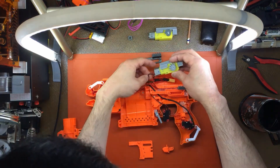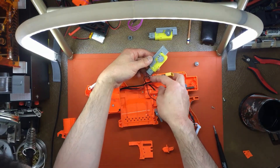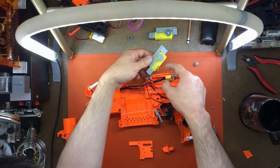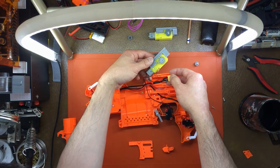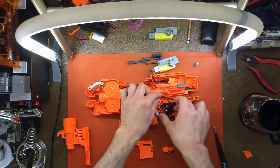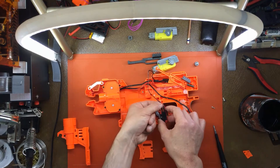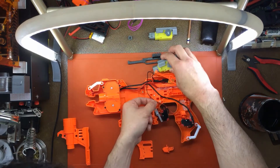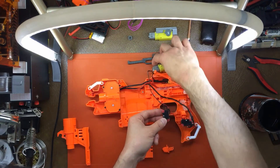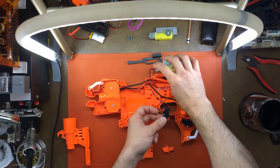You can see that there is a line here that goes directly to the negative pole of the XT60 connector — so the negative of the battery. This normally closed line is the one that, when the switch is released, is normally closed and is creating the short circuit to this motor. So normally closed goes to the negative terminal of the feeder motor and creates a short circuit there.